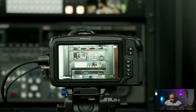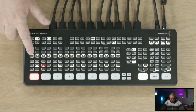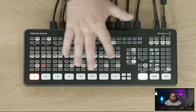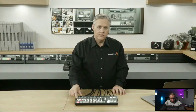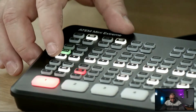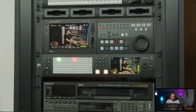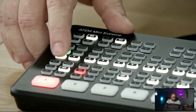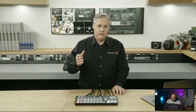But there's also other camera settings you can control as well. So you just need to select the override buttons. And those 4 buttons above here, you can see them on the overhead camera. There's all the arrows here for the iris. But these 4 buttons will override those up and down buttons. And you can say, for example, we can press gain or, well, that's black, and then we can adjust that setting. Whoops, there it is there. You've got to be fairly quick. So now there's buttons for overriding the levels for shutter speed, black level, and focus.